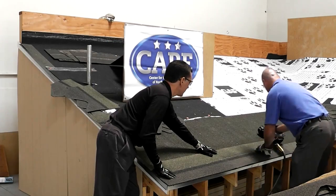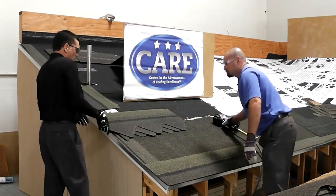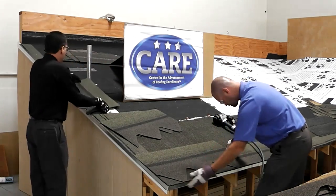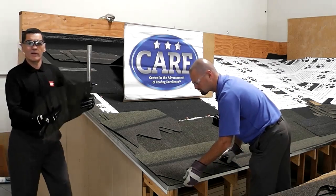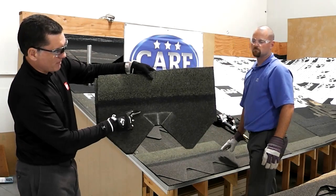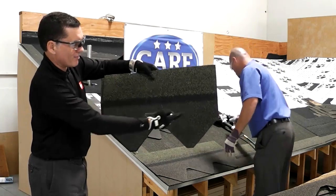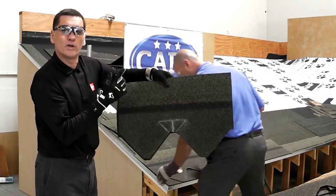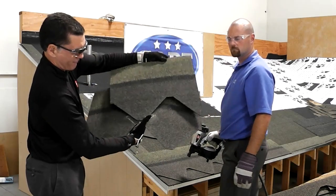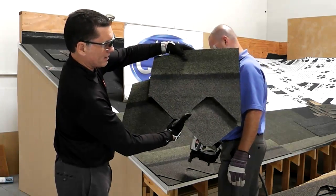Let's give James a hand here. So we're going to put a full shingle, and I want to show you with this diamond shape particularly — you're going to have an area where we're going to have to install the nail. We already marked it here: the line of the diamond that comes above, and also this line here is for the laminate portion of the shingle. If you look at the shingle with another one above, the diamond from the shingle above comes right here and covers that entire area.